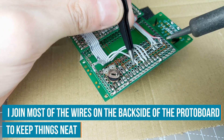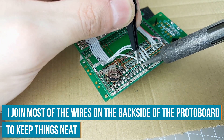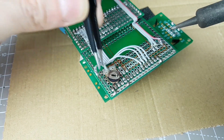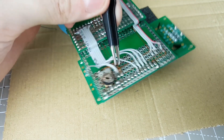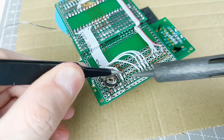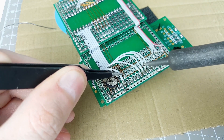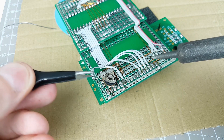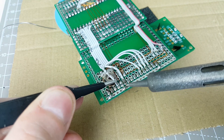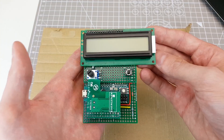Now I'm joining up the ribbon cable from the other circuit. This angle is a bit awkward because of the camera, but tweezers definitely help. I've already added solder to the pads and I've tinned the wires too, so I can join them just by adding some heat to reflow the solder. The last wire fights me a little bit and I should have secured the board a bit better — sometimes even just putting something heavy on top to stop it moving around can help. And there we have it.